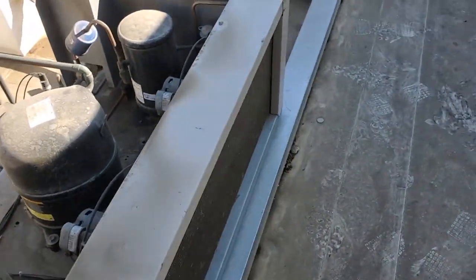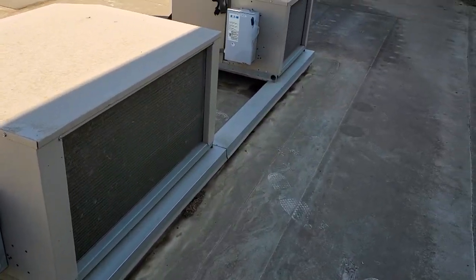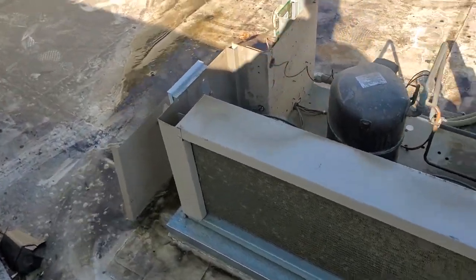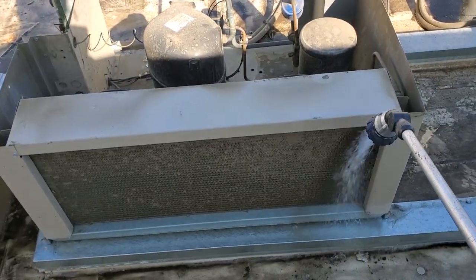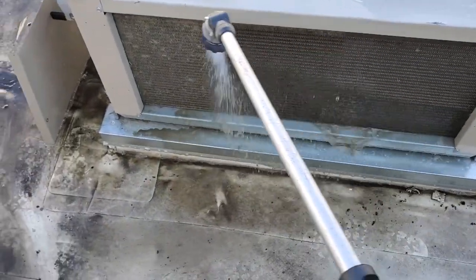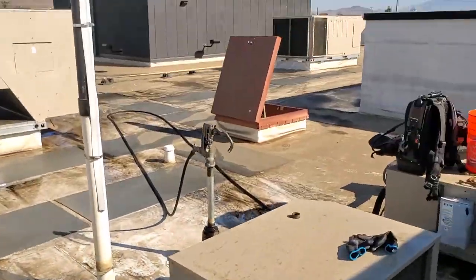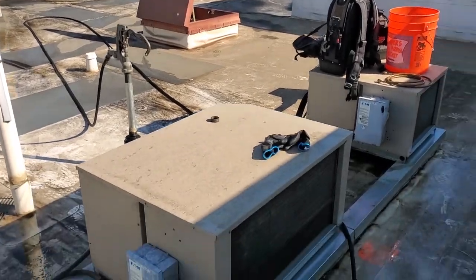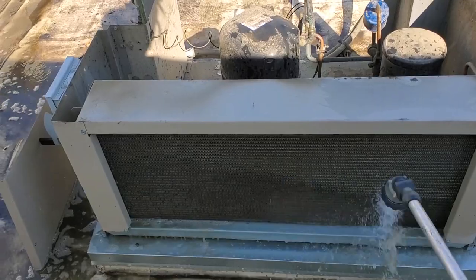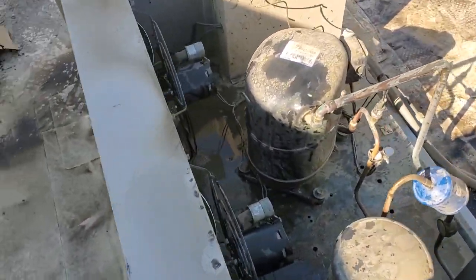The condensers look really dirty, so we'll give these a clean too — all of their condensers look dirty. I got the disconnect switch shut off, verified power, and we're going to give this a quick rinse from the front, trying not to blow it in. It's kind of dirty. I went ahead and quickly hosed off all their other equipment too — they had other condensers and I just gave them a quick hose.